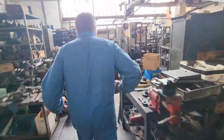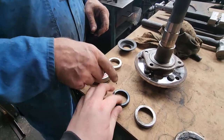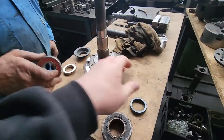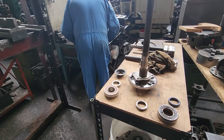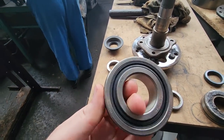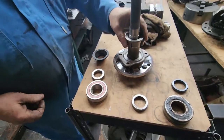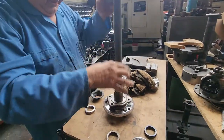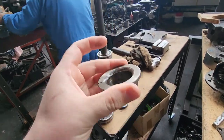So these are 4140 shrink rings - the ones that come with this bearing. They come with the bearing, these shrink rings. I haven't bothered to measure on a Rockwell test, it's probably not 60 tonne tensile, it's probably 40 tonne. The ring you use to press on a bearing - that goes that way, the seal faces there. See this ring? You can use that to press the bearing on with.